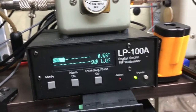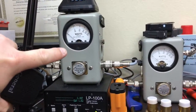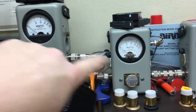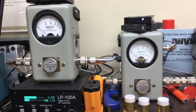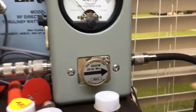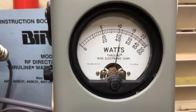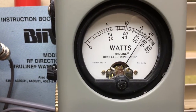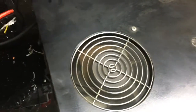All right, we'll go to the birds now. Here's reflect. Reflect to the radio, 5 watts, 25 watts to the antenna. Nothing. 1,000 watt slug, in peak, reading the bottom scale. Audio. 700 peak, straight forward with just radio drive. So now, let's go ahead and hook up a little 2-pil 1446 driver, and we'll be back.